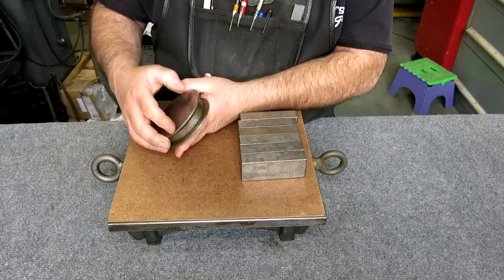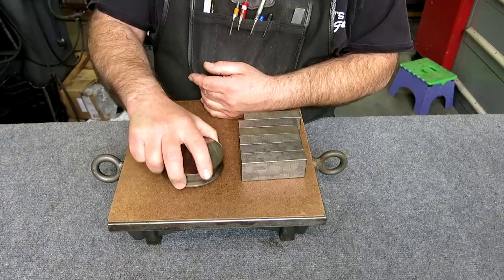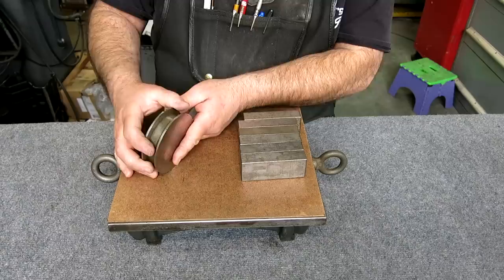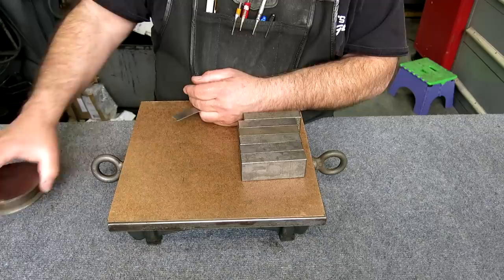This is a little toolmaker's flat that caught my eye — I liked the way he did the groove here. It needs a regrind and a lap, but it's about four-inch diameter. It's got a nice recess so it's easy to pick up and move around. If I were to do another one, I'd do a rectangular recess like Robin did so you can use small clamps on the rim, rather than a tapered edge. Still a nice item.